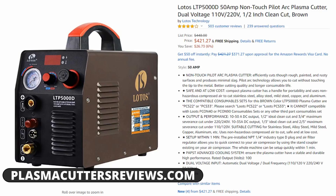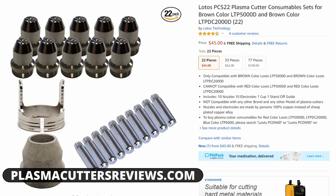Speaking of consumables, this is both a pro and a con. The consumables for these machines are very cheap, so it's a pro in that you can get a lot of them for less money. As you can see here, a 22-piece kit for the LOTOS is about $45. For a Miller or a Hypertherm, you'd easily be over a hundred dollars. However, the consumables are not built to the highest quality, which results in cuts being slightly less precise, and they tend to burn out a little bit quicker.